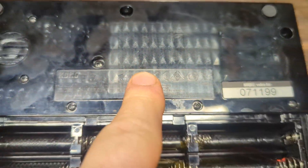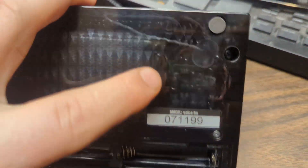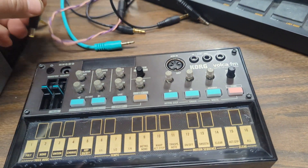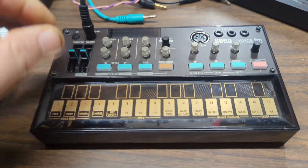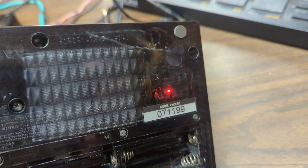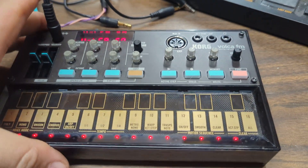With a clever application of a thin lithium polymer battery and a circuit board right there that does conversion. The board only supports eight volts in for charging, so there are two diodes in a row right before it. So when you plug it in, it charges the battery — actually charging off the nine-volt Korg adapter.